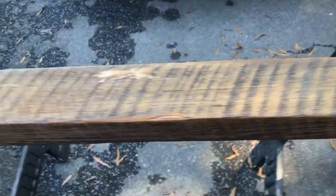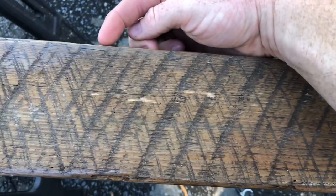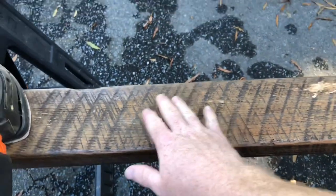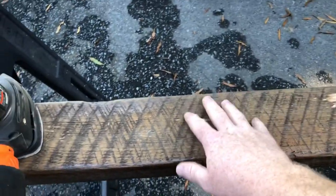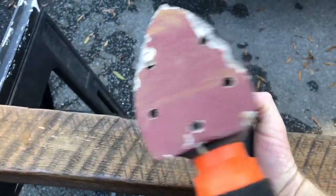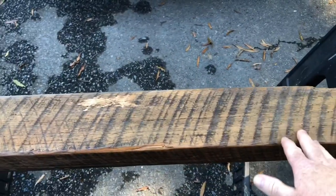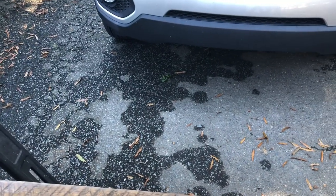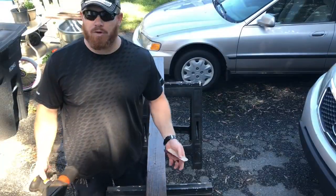Just to show you the difference — that's what it looked like before, and that's what it looks like after. I'm back — and by that I mean it's tomorrow, but thanks to the magic of video it's a seamless transition. This side is unfinished with the little strands of wood that didn't sand down well because it was still damp. Now it's dry, so I'm going to re-sand this side with the 100 grit until it's smooth, blow it off, and then finish it.